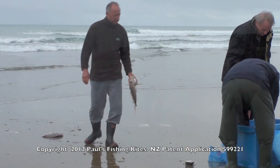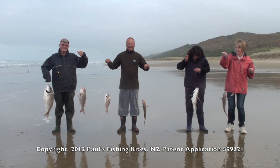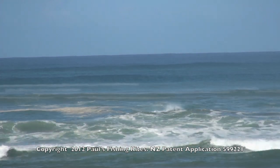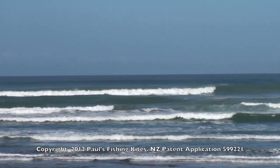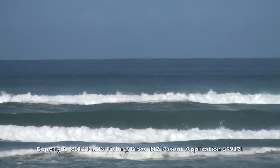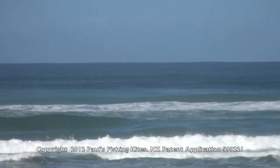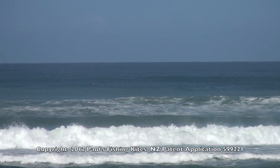We also met Barry Southgate on the beach — he's second in from the left — and he told us he has lost Kontikis twice to sharks off this section of coast, so he's pretty keen to get his hands on a Sure Thing as well. Here we see some earlier trials where we've got no float on the Sure Thing. We ran this trial without a float just to see what would happen if it rolls in the surf on the way out — and it had no effect. The gear still deployed perfectly and we still caught a few fish on it. The surf on this day is 2.5 metres, breaking out to 5 or 600 metres offshore. These are pretty challenging conditions but they haven't presented any problems to the Sure Thing. We set it three times on this particular day and had no issues on any of the sets.